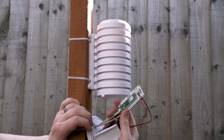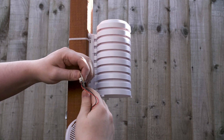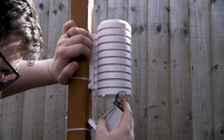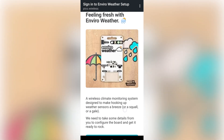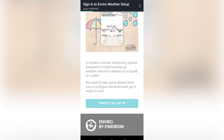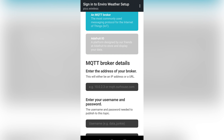Plugging in the battery pack to the board along with the rain and wind sensor cables and switching the battery pack on, you'll be greeted with a rapidly blinking white LED. That is your signal to fire up your phone and connect to the Wi-Fi hotspot it's created to provision it. The setup menu looks great if kind of buggy, and basically asks you to give it a name, connect a Wi-Fi network, and then tell it where you want to send its data — locally, to a web socket, an InfluxDB, MQTT, or Adafruit IO.